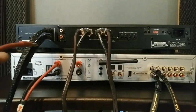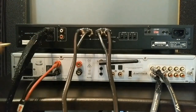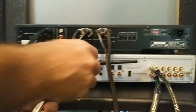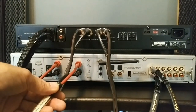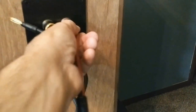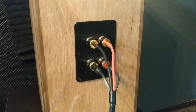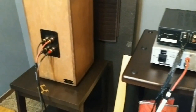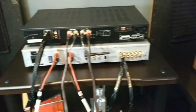Let's get the speaker cables hooked up — negative, positive. Remember, this is going to be for the right high frequencies. The other end I'll be plugging into the right side high frequencies. Basically the Audiolab is just going to be driving the tweeters. Now let's have an overall look — yes, this is a lot of cables, but it's very easy to bi-amp, very easy.